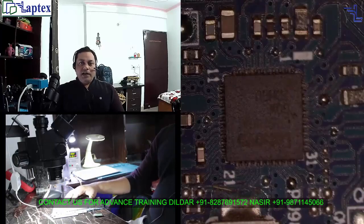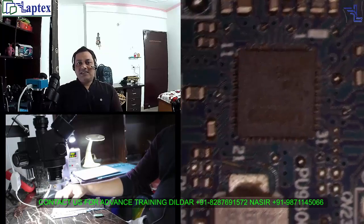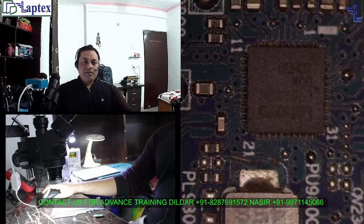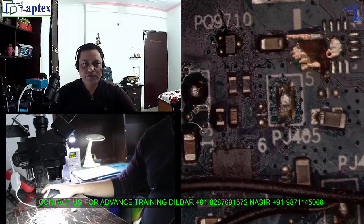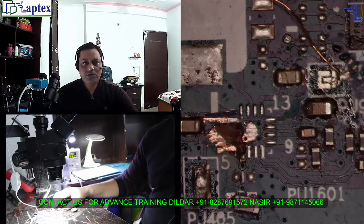The LVIC is responsible to generate your RAM regulator, your VPP regulator like 2.5V, and also it generates the 1.8V regulator. This IC requires 5V VCC which is coming from the LDO. I will come to the schematic and explain the logic of how this IC functions. The problem is you have no 5V LDO as of now because this is the buck regulator with PWM, and you may get confused whether to give 3.3V LDO to enable the LVIC. We have done some manageable work and I would like to disclose all the tips.